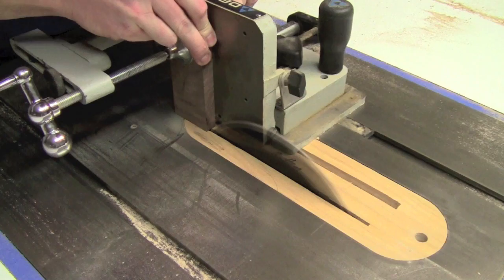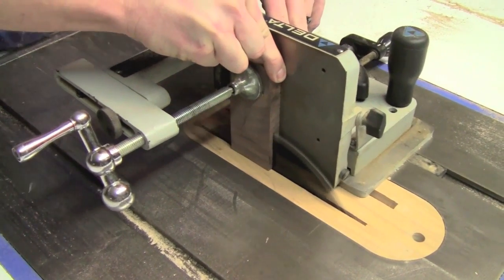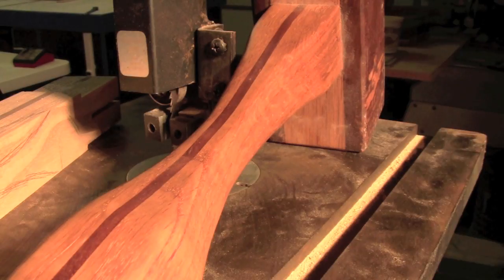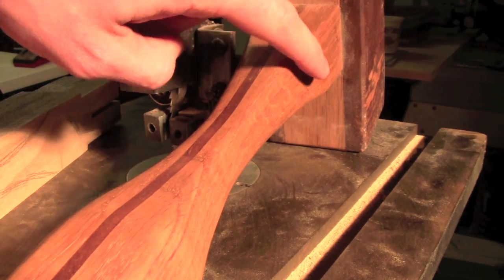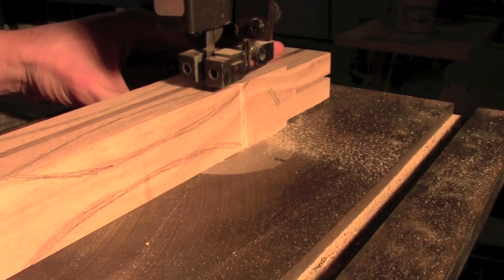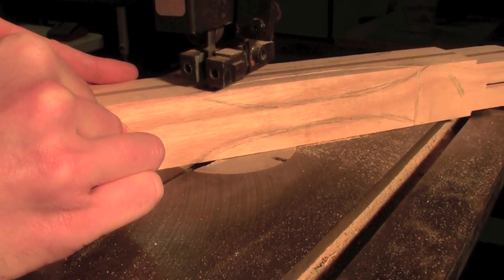Right now I'm just going to go ahead and cut the splines to the appropriate dimensions using my tenon jig. To shape the actual curvature of the handle, and if you notice on my original here, I've cut out a section here as well as here and then shaped it with the sander and just rounded over everything to make it a nice handle for my hand.